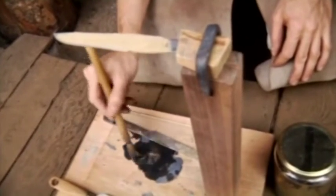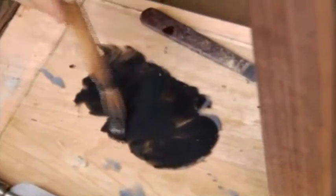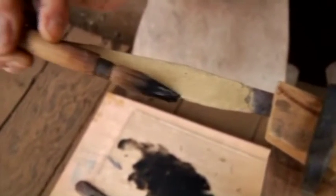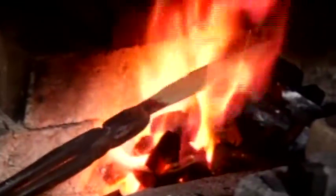At that point it's still not considered a blade — it's still just a piece of steel shaped like a blade. The critical moment when the blade is born is when it's hardened. A Japanese sword has two different hardness zones: the edge will be very hard, which makes a good cutting edge but is somewhat brittle, and the rest of the blade will be a really tough steel. That's caused by the hardening process unique to Japanese swords — you coat the back of the blade with a thin layer of clay, which acts as insulation so that when you plunge the hot steel into water, the edge cools really quickly and the rest cools about half a second later. That little difference gives you the two different hardnesses. The only problem is it's very stressful on the steel, and sometimes when you quench a blade it'll crack — after 10 or 12 hours of work, the whole project is back to square one.